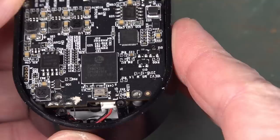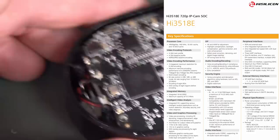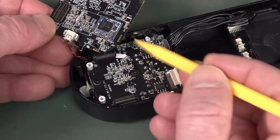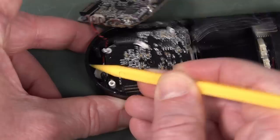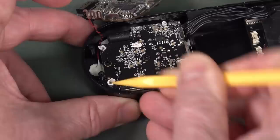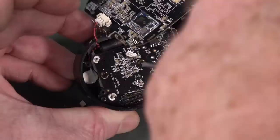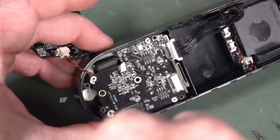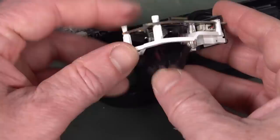I'm not going into huge detail here - those playing along can look up the part number. It's just a purpose-designed ASIC for this sort of job, used in dozens of different branded products. Something's cracked off - dodgy little plastic standoffs. They just shattered - poor quality plastic. There's a board-to-board interconnect and there's your Wi-Fi interface on a separate board. We can get this out - ta-da! And there's your camera module.